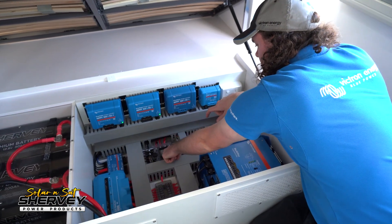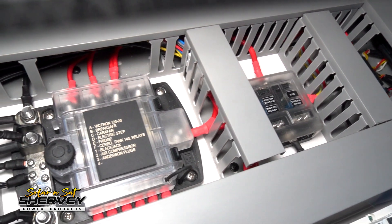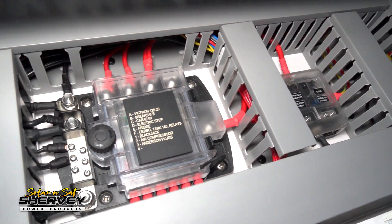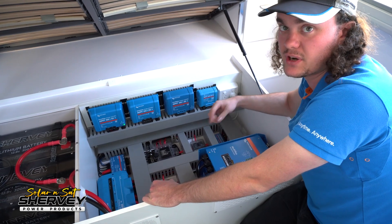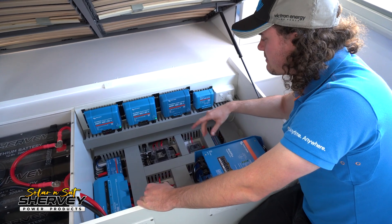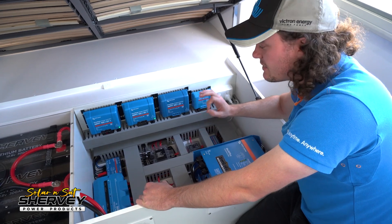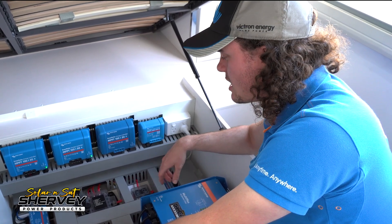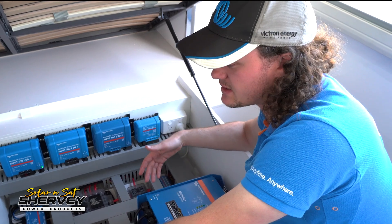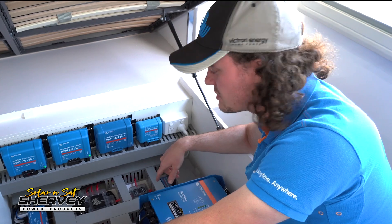This second fuse block — our medium-current fuse block — and all its negatives are only hooked up to loads, and they pass through the second shunt. That gives us a DC loads output on our touchscreen. If it tells us we're using 97 watts and we're producing 300, that is on the money. It's no longer an implied reading like in the old systems, which is super important on smaller caravan systems where the difference between 50 watts and 100 watts can be substantial.